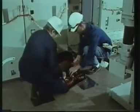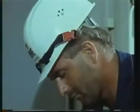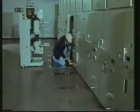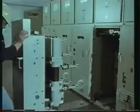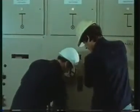After completion of work, the tools and equipment must be removed. The plant supervisor is notified on completion of work and issues instructions to make the plant ready for operation again. The safety measures can now be removed in reverse order: remove the safety chain, remove earthing and short circuiting. The second safety measure is removed by reinstalling the switch trolley and switching on the control voltage. The plant supervisor can switch on and in doing so removes the first safety measure.